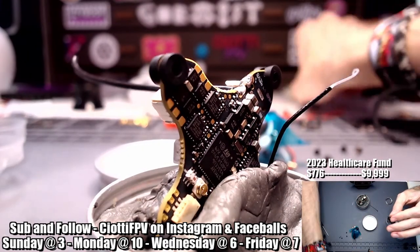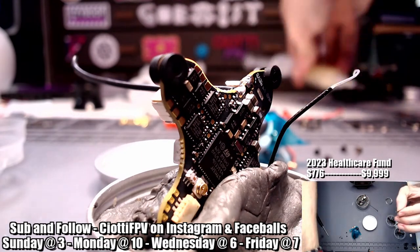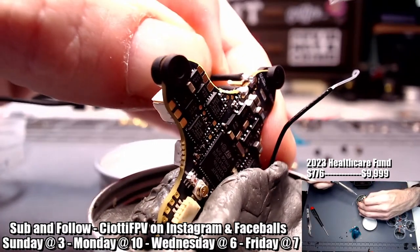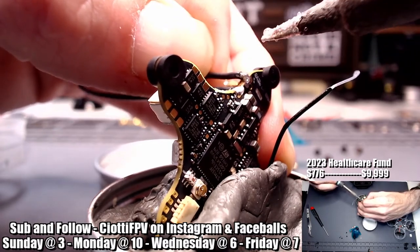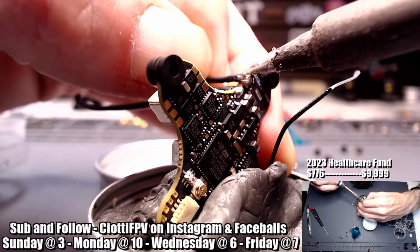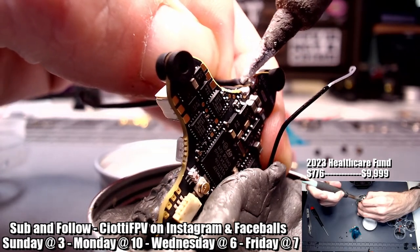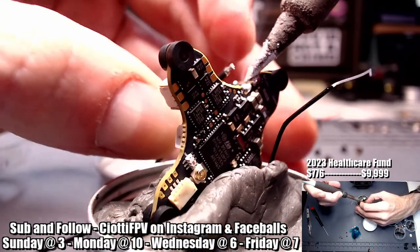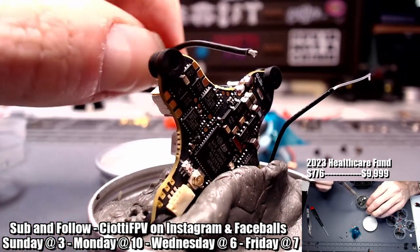all right, hold on, let me get a little bit of flux on the tip of this wire. Okay, this wire is not tinned quite enough at the moment, but there's a lot of solder on this pad. So as long as I can get the wire to heat up, which I should be able to now that I put flux on it, we're gonna be all right here. The solder flows towards the heat, so the additional solder, ouch, that's on the pad here is gonna flow up onto the wire.